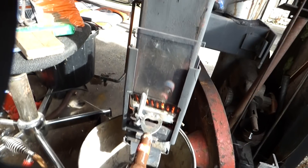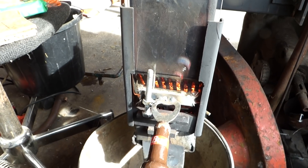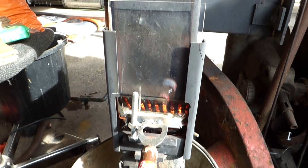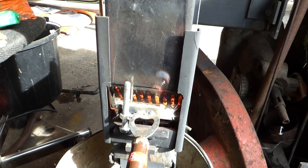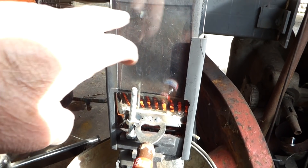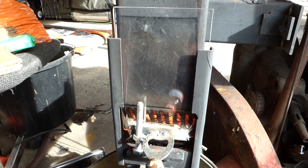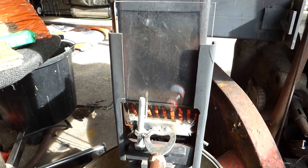The next upgrade on the front: I've used a piece of high temperature glass — it's rated to 700 degrees. I bought a window and cut it in half, and that gave me exactly what I wanted for my fire. To cut it, to make it easy if you want to cut some yourself: I sprayed it with 3-in-1 oil and then used a diamond cutter across it, just as you'd cut a normal piece of glass, and it came out perfect.